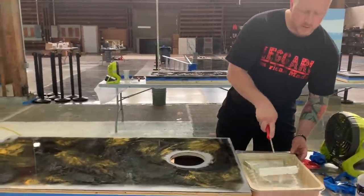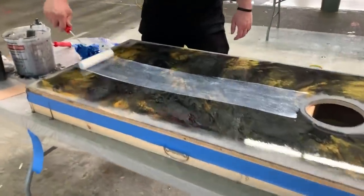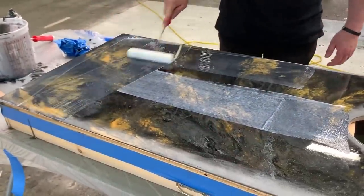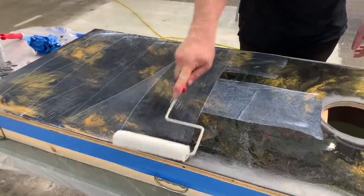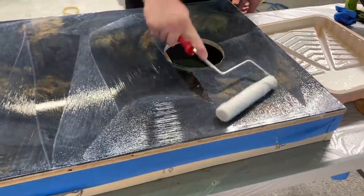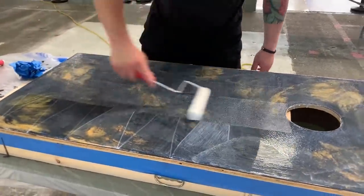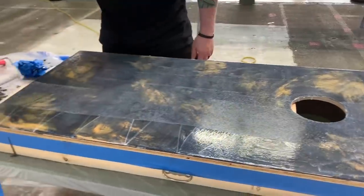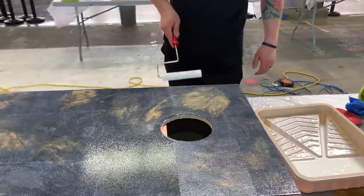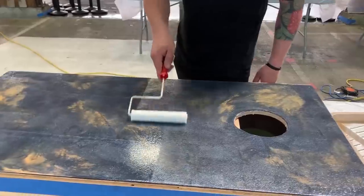So I'm applying the urethane top coat. It seems thick but it's not — it's a phenomenal top coat. I'm just saturating the whole roller, going across the middle of the board first, and really just smearing it over the whole area, trying to spread it all the way across the board. It's just not a very big area. Then I'll lighten up on the roller, let it roll a little bit, and do one final back roll three quarters of the way. The beauty of this urethane is it's amazing — it is so user-friendly. You're not going to have any roller lines.